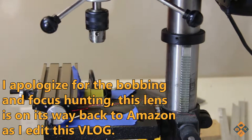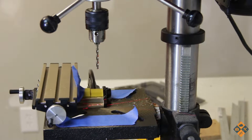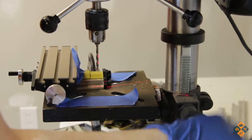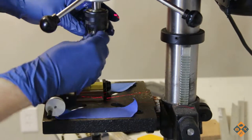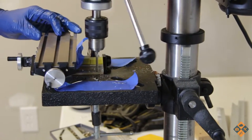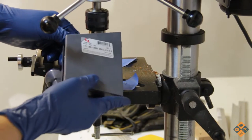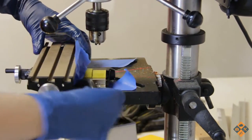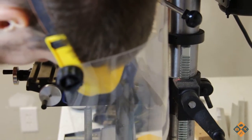I went ahead and countersunk it. I didn't film that because of the dirt - I'm tired of my hands looking like a freak show. After a while all these chemicals start giving you weird dermatitis, and that's never too good. I want to use a smaller bit on that right now because it's not matching up with the hole just yet. You always want to start with a small bit and work your way up. Make sure your drill bit gets seated in the chuck properly. Visor down. These Chicago Latrobe drill bits - I cannot recommend them enough. I'll put a link in the description. The laser sight works for a little bit, but they won't stay aligned very often, especially if you're doing metal work.